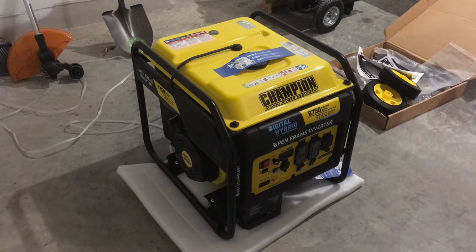So this is the unit I ended up purchasing. Why did I choose this unit? A few things. One is that I wanted an inverter generator. Looking at the other generators, though they're slightly cheaper and produce more power for the price, those generators are not good for sensitive equipment. Basically, with the other generators, if the motor starts spinning slower, you're not getting perfect 60 hertz. There are things called harmonics — THD — that come into play and could ruin your electronics. I'm not an electrical engineer, so I can't go into the details, but I did quite a bit of reading on that.